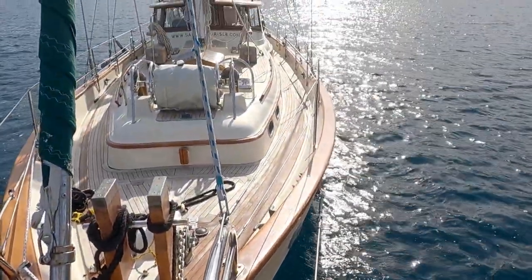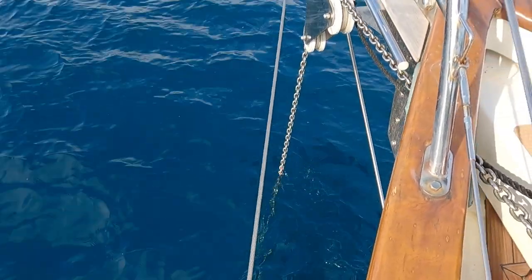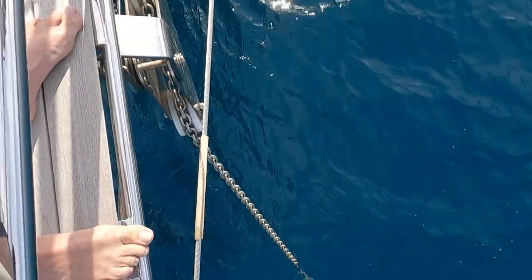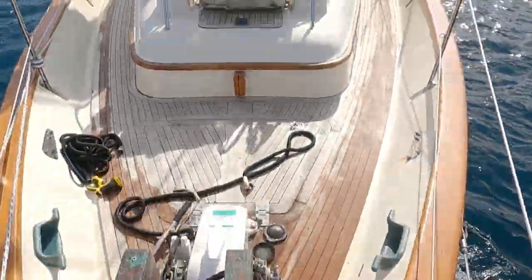There's a lot of force at play here, especially with a heavy boat like ours, so don't be tempted to bulldoze your way out — you'll break something. Once you're in position, tighten the chain with the windlass and slowly pull backwards. I think that might be free — I did feel movement, but the skipping tells me it's probably not released.